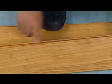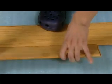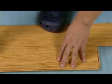Position the long side low hook of the first converse panel into the long side up hook of the previous row panel. After positioning, you should see there is a gap along the joint area. Then use the rubber mallet to tap the up hook joint area. The panels will lock into place together.